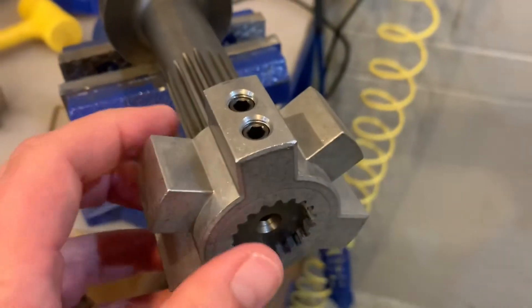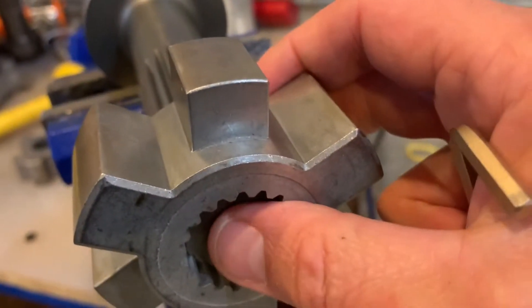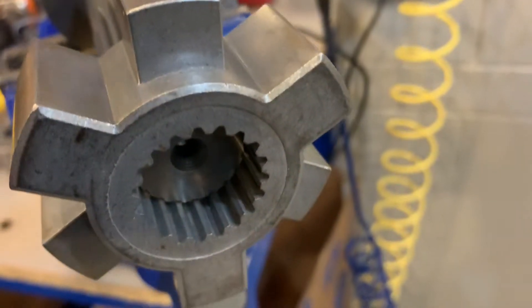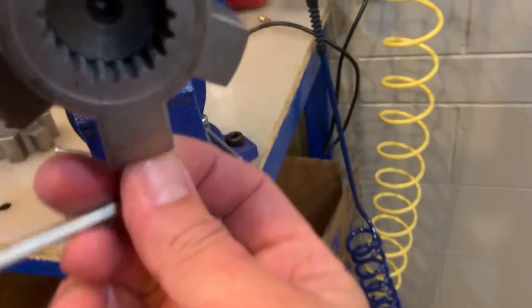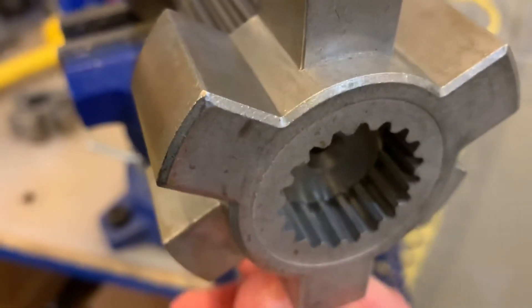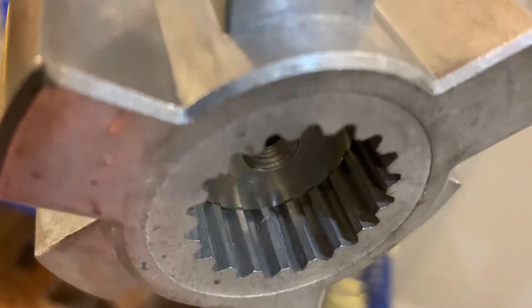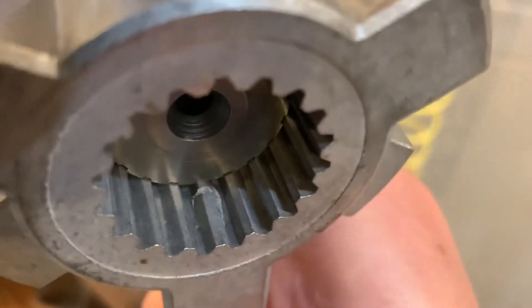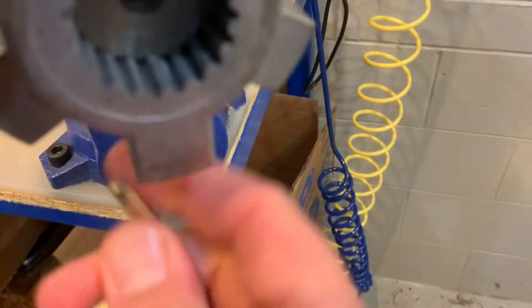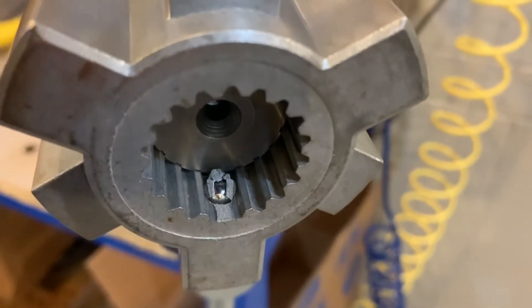What I want to show you is what could happen if you do not install this hub on the shaft before tightening those screws. I've located this hub on the shaft and I'm going to show you what it looks like if that front screw is not over the actual pump shaft. I'm going to tighten this bottom screw and we're going to watch what happens as it breaks through. You can see that the material is deforming — and that's what it's supposed to do on the shaft — but if you torque this without putting it on a shaft, it will completely break out and this part is no longer good. Make sure you locate it on the shaft before tightening these set screws.